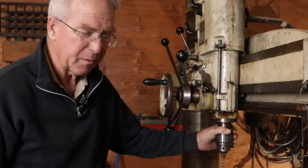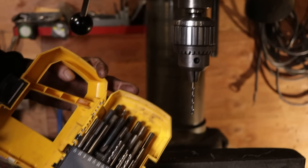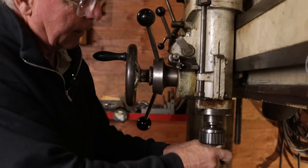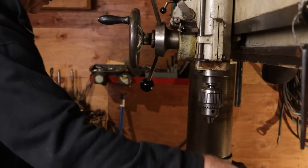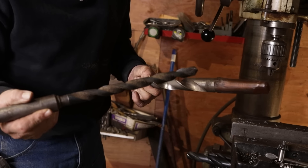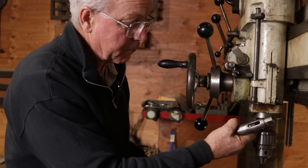So this is a Jacobs Chuck. I don't know the history on a Jacobs Chuck, but I can tell you that it works for kind of a standard assortment of bits. It'll go up — I think this is a 5/8ths Jacobs Chuck — and it'll take up to a pretty good sized bit. You just put the chuck key in there and you loosen it up and it works great. But obviously that is not going to work for a bit like this. To do that, you use the Morse Taper chuck that comes as the standard integral attachment point for this drill.